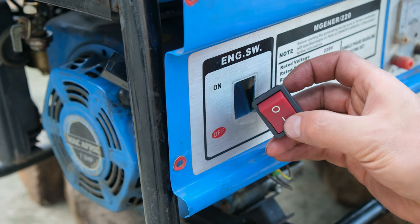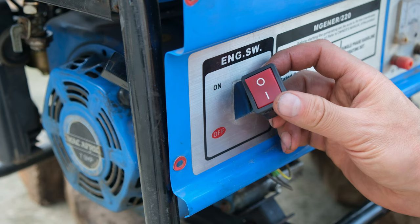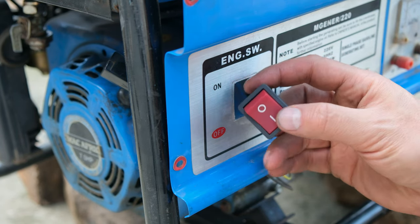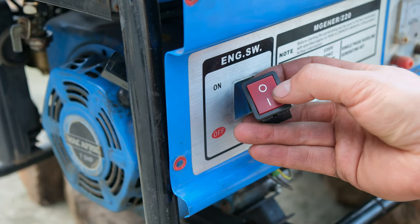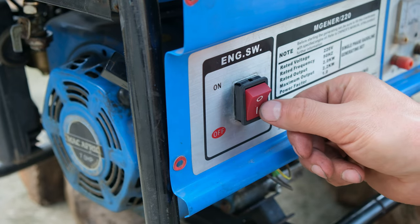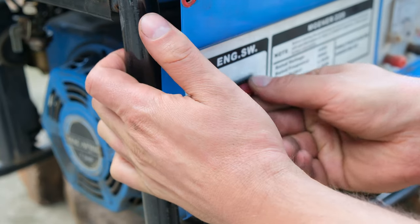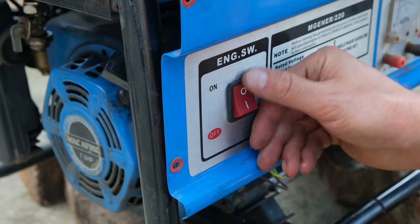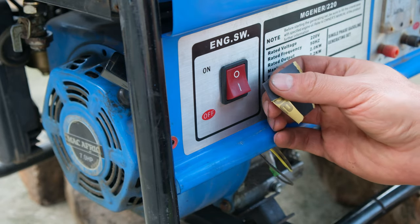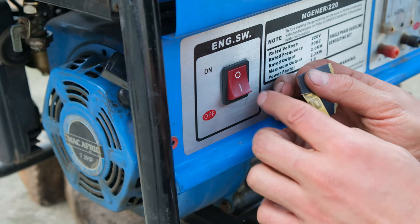What's happening is this scale does not correspond with the faceplate's scale. Either I would have to blank that off, or I can remove the scale from the switch. I'm going to remove the scale from the switch and insert it the way the old switch was inserted. I press it in like that - there's the new switch - and I'm just going to remove the one and zero markings because I'm going to use the labels on the faceplate, since they do not correlate.